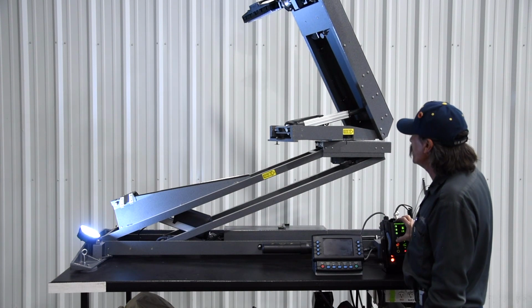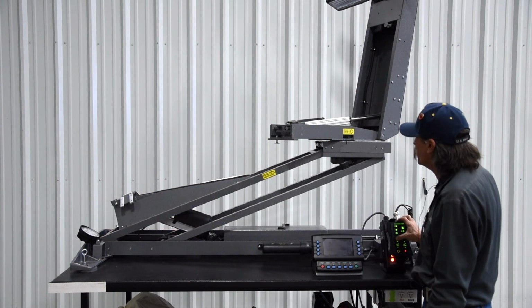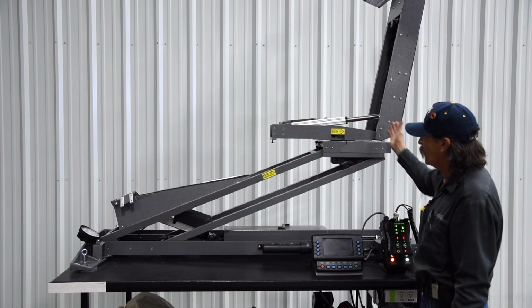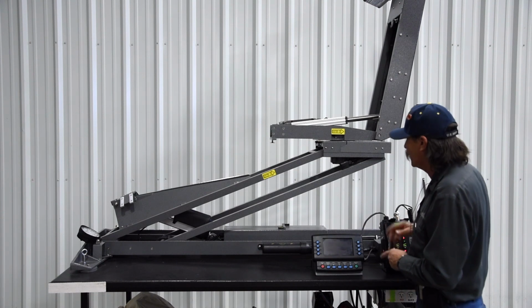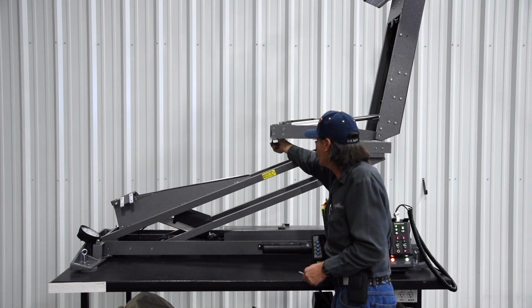The furthest extreme for the center sensor to pick up would be here. As you can see, it starts to pitch the rotation platform up a little bit. So that will make that distance a little bit farther. That's the one you want to make sure is picking up right there. It will pick up in all other extremes if it will activate at that point. For the down limit and the nest sensor, there are just a couple of spring-loaded contact plungers.